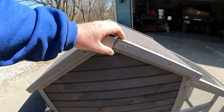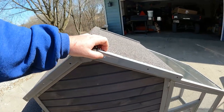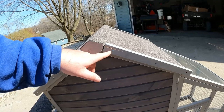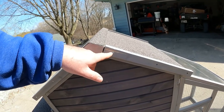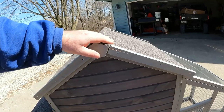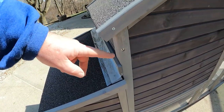Unfortunately, our kit did come with a little crack — some wood glue, a little screw, easy fix. It wasn't a game changer. But typically with these products, when you drive screws into dry non-quality wood without pre-drilling, you're going to get this split. A lot of our major holes were pre-drilled on the front half, but not on the back half.